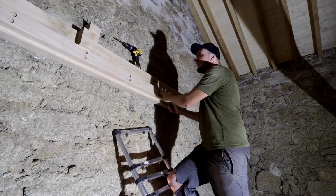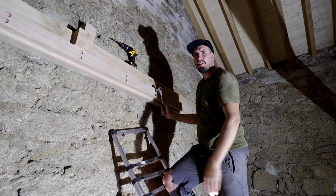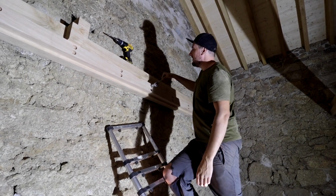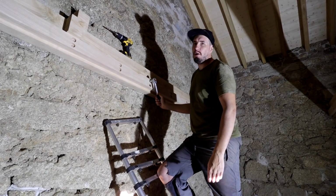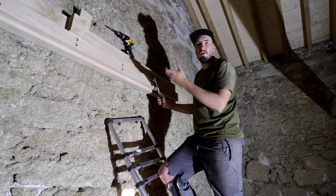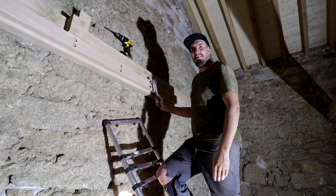There. I've got 4 more pairs to do after this one. My arm feels like it's going to fall off. I don't mind taking over those duties if you want. It's all good. I really wish you could use an impact driver with these bolts, but they're not heat treated, so if you tried to use an impact driver they'd just melt and snap. I know from past experience.